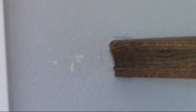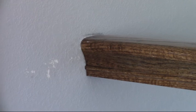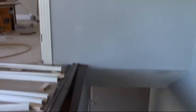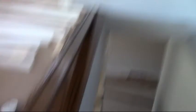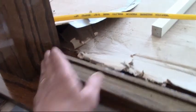Before I put in that shoe rail, I'm going to fix some paint problems. When we put the shoe rail on, we scratched it right there. So I'm going to dab a little paint on there with a paintbrush. And right up here there's a pencil mark on top of that handrail that is hard to remove, so I'm going to do some painting around that as well. The wall's been touched up now on the bottom and on that side. The paint's still wet so it might be a little bit shiny, but hopefully it'll dry the same color and no one will ever tell. Now I'm putting down this shoe rail, which is going to fit perfectly like that — bang.